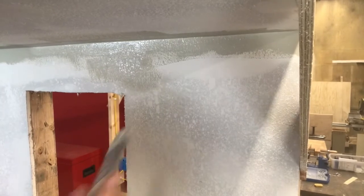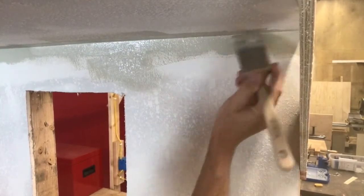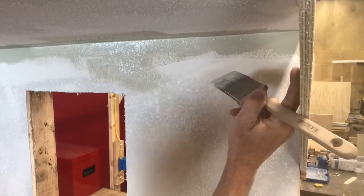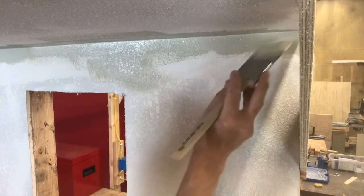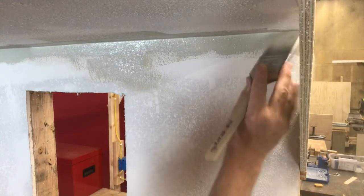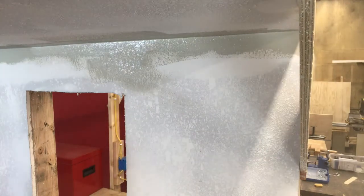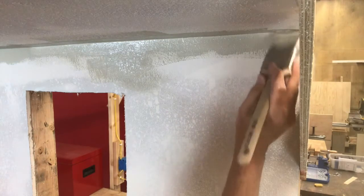We're going to turn it over so you can kind of see we're getting into a corner where I cannot reach in if I have the brush angled in the incorrect area. We'll be running into obstacles. Maybe that's the wall and corner area. But in our case, if you turn it 180 so that the angled brush, the long end, is in the corner, you can just reach right in and comfortably finish up that cut in all the way to the next wall section.